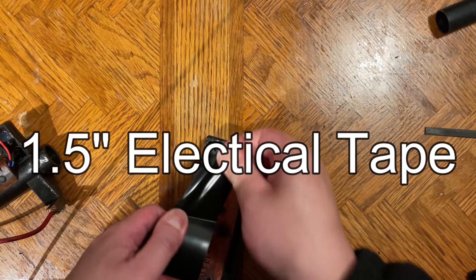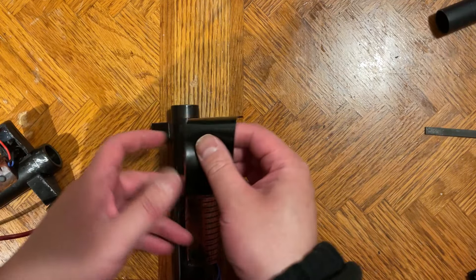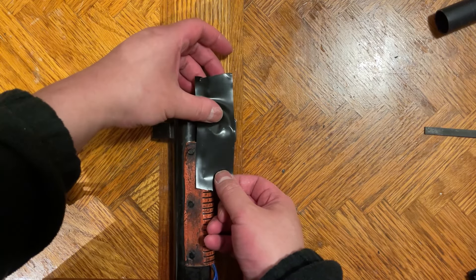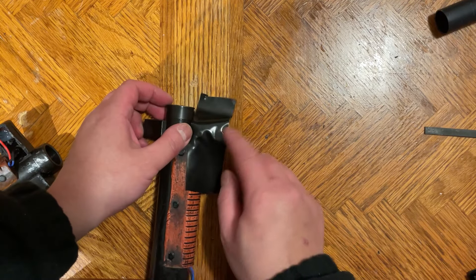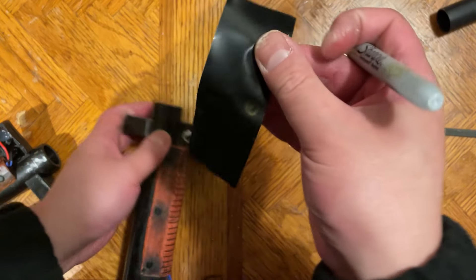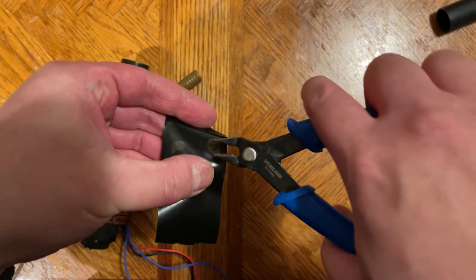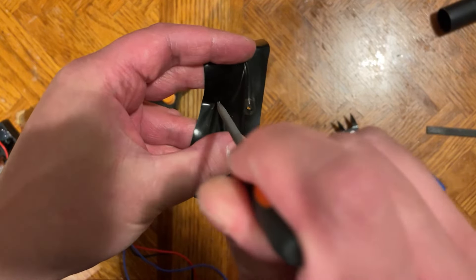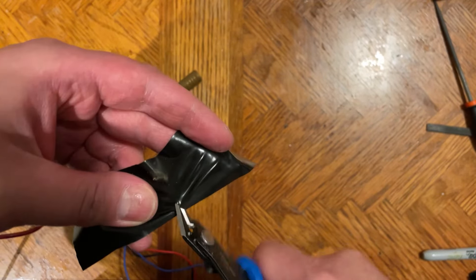Now that you know how it's done: put the yellow one into positive — make sure it's on the right side — and black goes on the left. For the blue one, this is the momentary switch button, and it doesn't matter which one goes into which slot. Give them a light tug to make sure they don't come off. Then plug these in: starting with the top body LED, this goes into HAT2 right here; the other one goes into HAT1 right next to it; and the momentary switch button goes at the very end. Assuming you didn't unplug anything else from the board, just leave the wave trigger and speaker off for now — plug in your pack and make sure the hat lights and momentary switch button are working, then come back to this video.